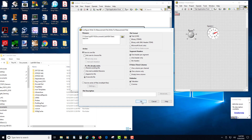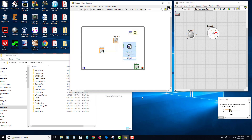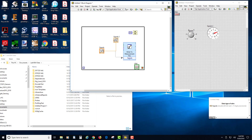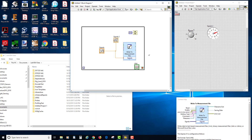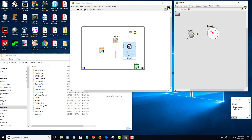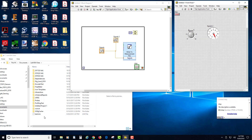This looks good for now, and I'm going to wire up the signal from here to the signal input — and it's happy. Now I'm going to run this for the first time. Watch what happens down here in the Documents LabVIEW folder that was part of the file name. When I run it, notice — it instantly created that file and it's actually recording data right now.